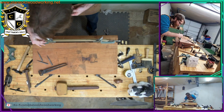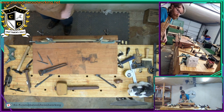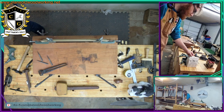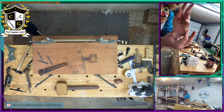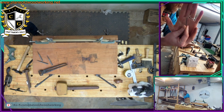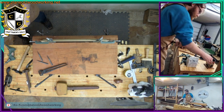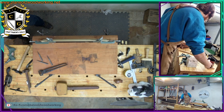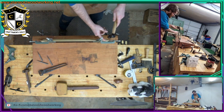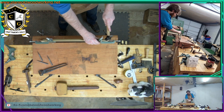Okay. Nail is in. Nail is in. So, Harley, just so you know, we are actually reinforcing the frame with, and Payne as well, with cut nails. These are cut headless brads. So regardless, I need to pre-drill holes anyways because they're not wire nails and they would most likely split the wood if I just tried to nail it in without that.